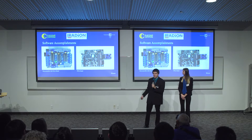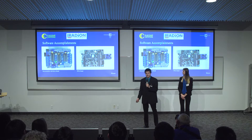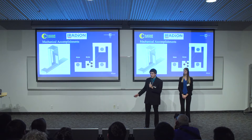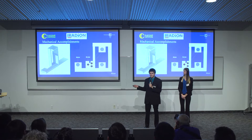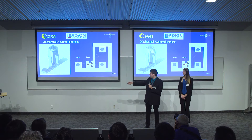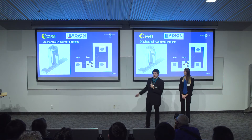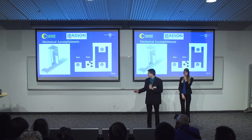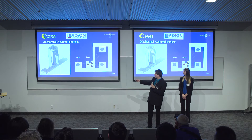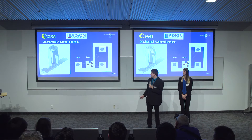On the right is an FPGA. We use it like a microcontroller, and this board allows us to control multiple motors at the same time. For the mechanical aspect of the project, we had to design a base to hold the motors while they turn the screws. On the left is a 3D view of the structure based off the previous design. The servo motors are heavier than the stepper motors, so support was added here so this side won't warp or break under stress. The motors are too large to be directly behind the screws, so they are offset and use timing belts to turn the screws.